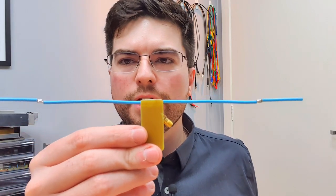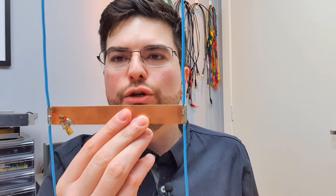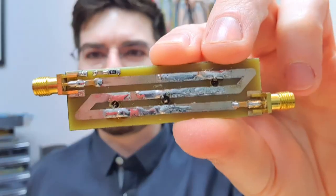The main idea of this amplifier is to use it as the output amplifier for a small scale phased array system using five dipoles — something like this dipole here, or this one with a reflector, which is called a Yagi-Uda antenna. This system needs five amplifiers to amplify the signal to the antennas, and before each amplifier we need a delay line. This delay line is used to control the phase of the signals.